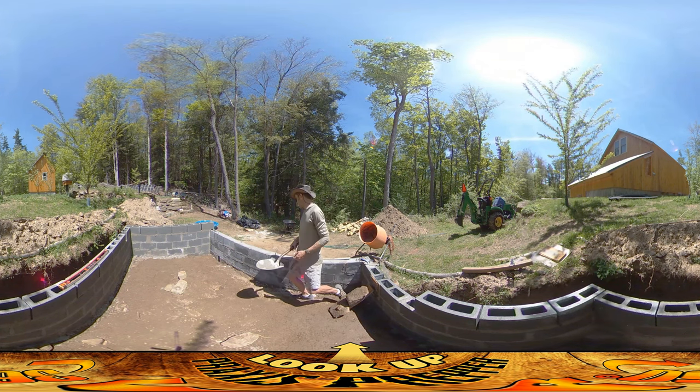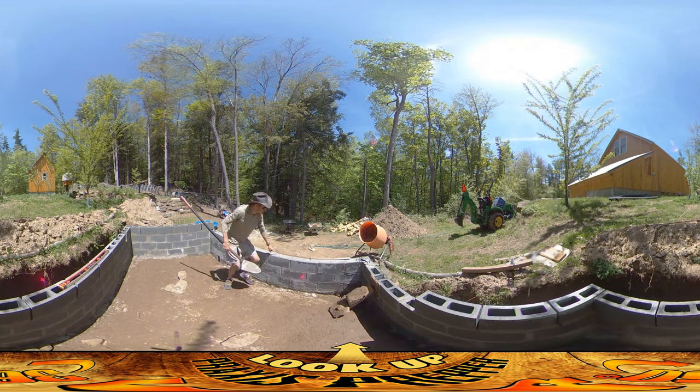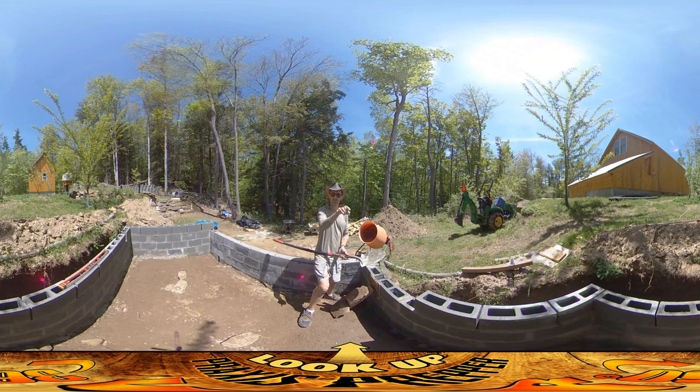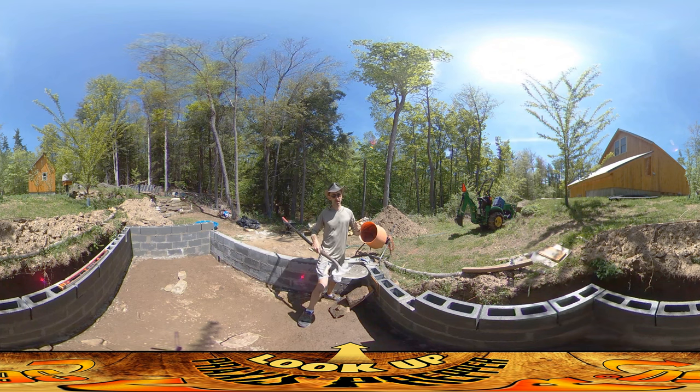Yesterday I was able to put in some of these anchor bolts. There's one every few feet on here. As you're putting in the anchor bolts, it's good to kind of skip from one side to the other of the wall as you go, and what that does is it makes it so you're holding down both the outside and the inside of the board as you're going down.